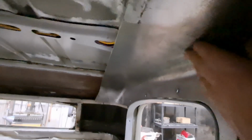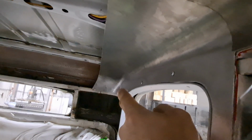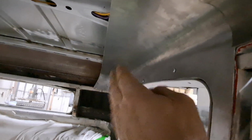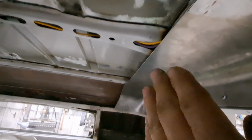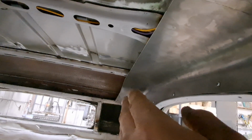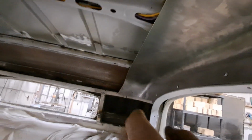But the transitions, very nice. From the 24 to the 18. This needed to be 18 because of all of the forming and wheeling that went on there. You see that taper in? This edge, this is the top channel that flows all the way down. That taper will be inside. It'll actually be straight cut down there.